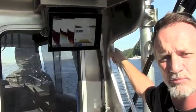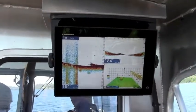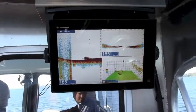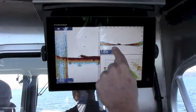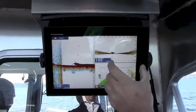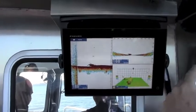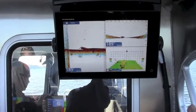We'll get out and look at some wrecks in a little bit as soon as we hit some deeper water. With the DFF3D, the multi-beam sonar has the capability to not just show a traditional down sounder sonar image, but we can actually show a bottom profile so you can see where the structure is on the bottom, or fish, or anything underneath us — every ping within that 120-degree sweep. We're breaking this whole 120-degree sweep up into 40 individual channels, which gives us very fine bottom resolution.